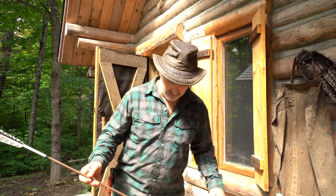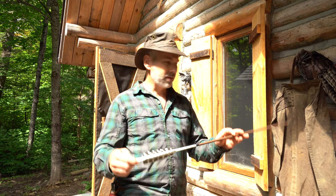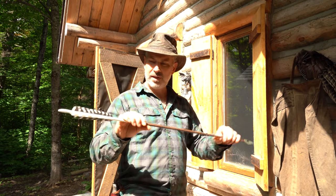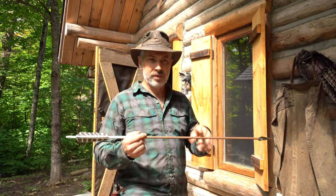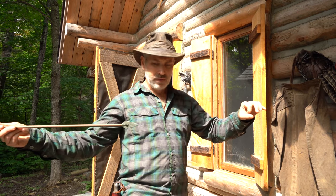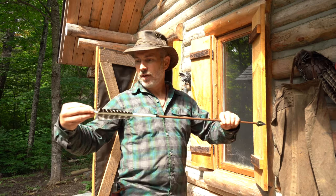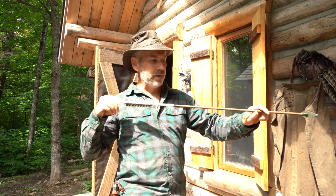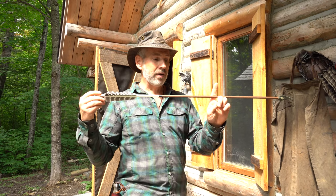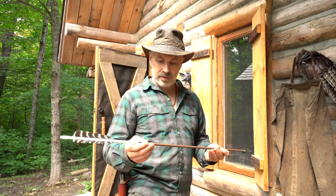The arrows that I was talking about, which are very, very nice looking arrows too. Nice stain on them. That's very similar to the ones that I make, with an ash shaft. I'm not sure if he bought these shafts or if he made them. I had made a jig years ago for a router. A couple of holes and little blocks of wood, a bigger hole on this end and a hole about this diameter on the other end, and I'd put it onto a cordless drill, and spin the arrow and then run it in past the spinning straight router bit, and it would shave it down to this size and thickness and roundness, and then just cut off the ends. It was very effective, actually.